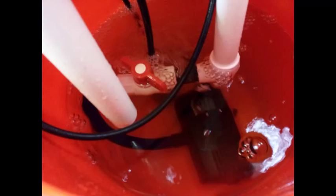The pipe on the right is coming out of my pump and going into the planters. You'll notice I have a valve set up on here, because my pump was too strong for gravity to make up for the overflow — it was pumping out faster than it could come back in and it was beginning to overflow the planters. So I put a female to female irrigation valve in there so I could regulate the water flow. Coming out on the left side of the valve is the flex riser, which goes from the regulation valve into the pump. It's always a good option to be able to regulate your water.